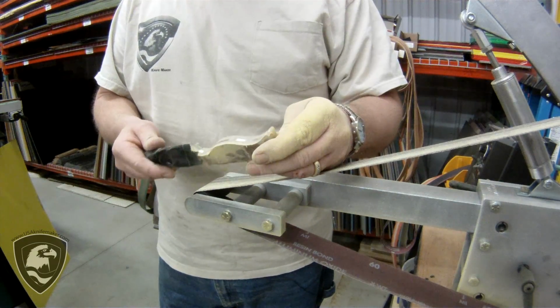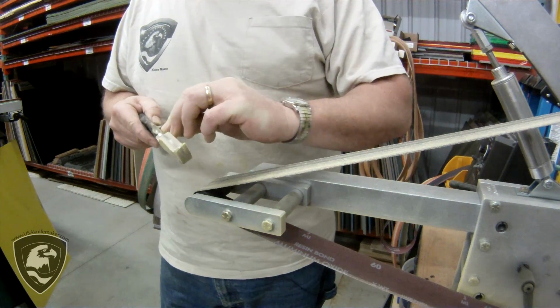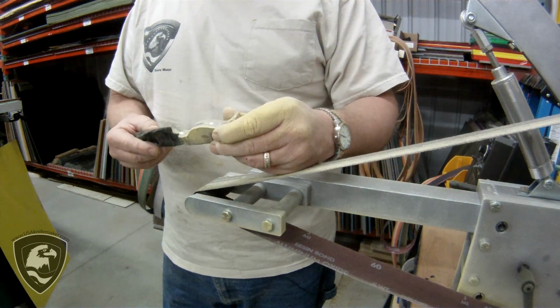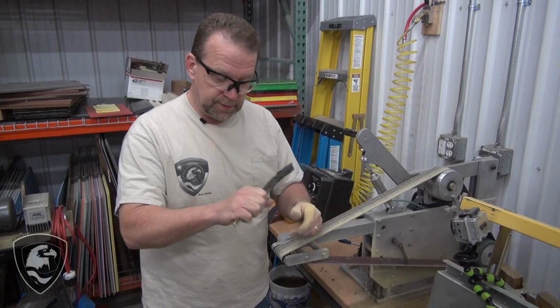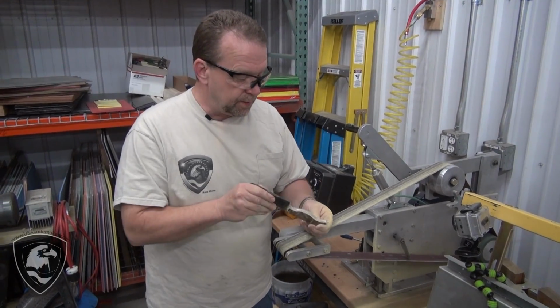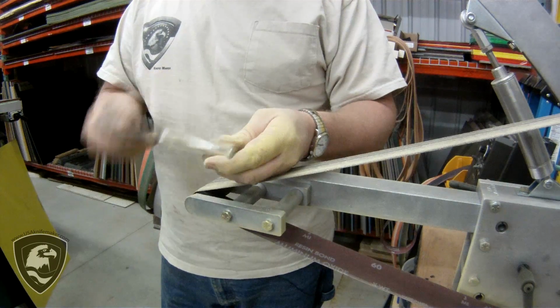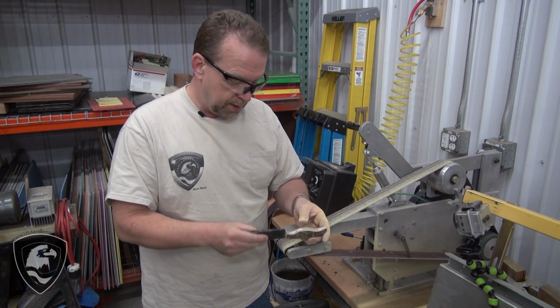Small wheel really makes quick work of getting those contours in. This happens to be a 3/4 1-inch wheel. Usually a 3/4 is the most common, for a finger notch right in there, and it just cleans out the profiles, gets in the smaller contours. They're just handy as a pocket.